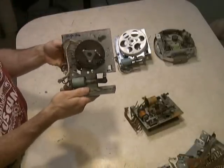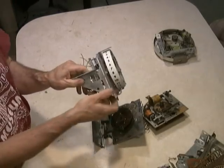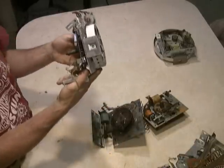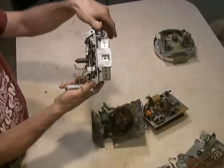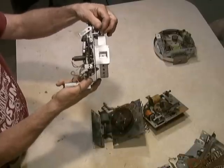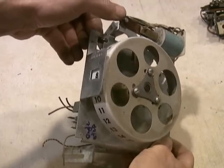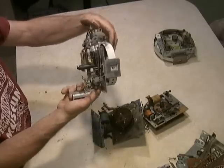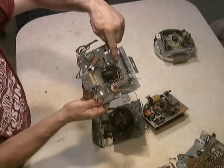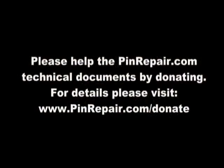Here is one out of a Gottlieb - same deal: advance a single step, and then decrement a single step. Another thing that's a single step that a lot of people don't think about as being a single step are credit units. This is a credit unit out of a Gottlieb - right there is zero credits. As the game wins, you get replays and it brings it up, and then as you play a game, it decrements and takes them off. This one is real sticky and having a hard time moving, but as I work it more, the grease frees up. What happens on these credit units is the pivot point typically freezes up from old grease solidifying.